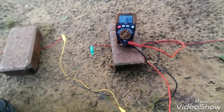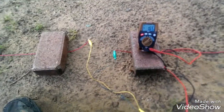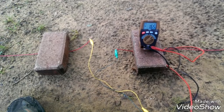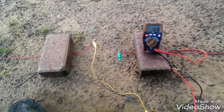7:45 AM — I'm showing a negative 16.5 millivolts at this moment. I'm going to go with that number; it's pretty stable. We're going to do one more reading at 8 o'clock. I'm taking up your whole first hour doing this, but it's very important that we catch this very first hour throughout the hour, because we're going to see an interesting spike in our voltage.